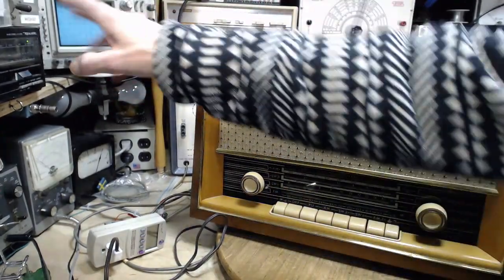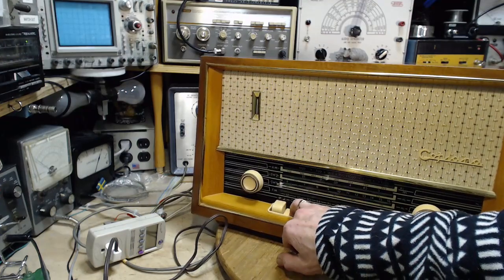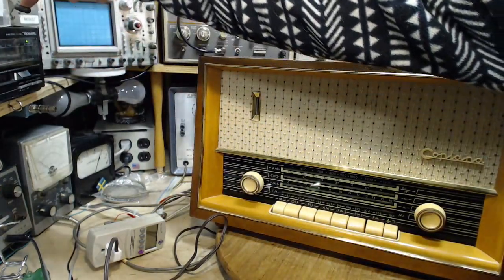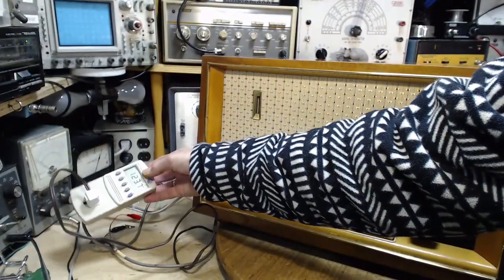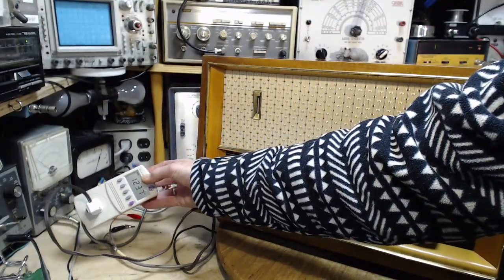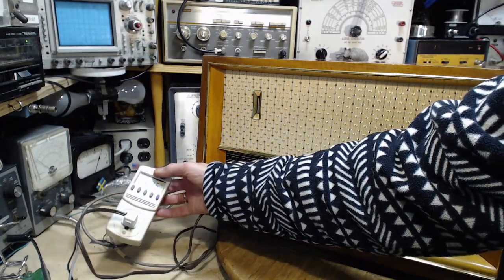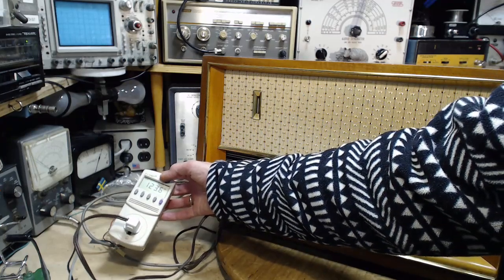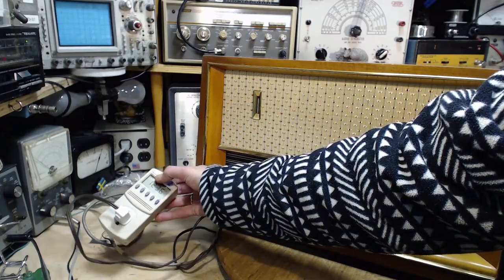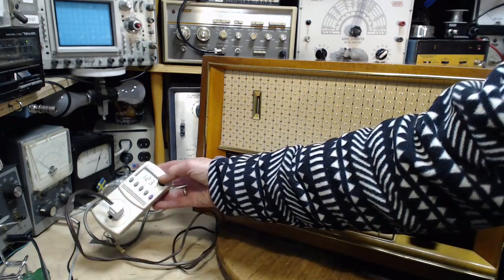That's right, so I was just explaining the panel here. So with the radio switched off, if I throw this switch downwards, power is now making it here. Well, you can see this little box here is kind of cool. It gives you the voltage, 123.7 volts. And it can tell you lots of other stuff, power consumption, whatever you plug in here. It's kind of a neat little box. So this is telling me exactly how much voltage is reaching the prongs on this cord.